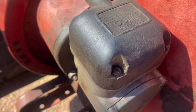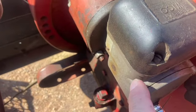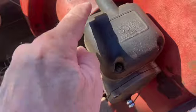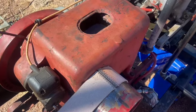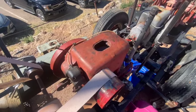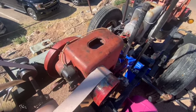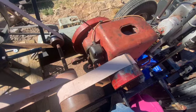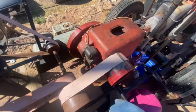The red one quit running on me — a big crack opened up in the coil cover all the way down on this side, and there's another one on the other side you can't see. The crack opened up so this thing is arcing all over inside instead of putting power out through the wire to the plug. But she had a really good run this weekend — I'm really happy with it and it runs really good. As you saw in the opening clips when I started it up, I am just tickled pink, this thing's back in action. I've got that other mag at home, and talking to the experts here amongst the old iron guys, they all pretty much agree that the impulse not working on mine is probably just a broken spring. I'll pull it apart this week and if that's it, I'll be in business.